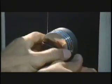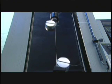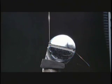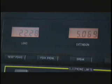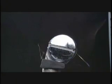Spools of wrap wire are then tested on our Instron machine. We coil the wrap wire around posts on the machine, stretching the wire until it breaks. A computer measures the distance and the amount of tension the wire was under before breaking. These strength and elongation tests validate the wire for use as a musical string.